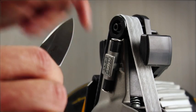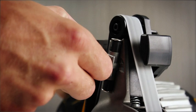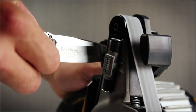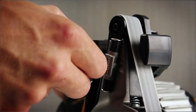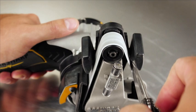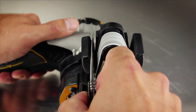Turn off the machine with the tip resting on the belt. After a burr is raised, repeat the same number of strokes on the other side. Once the blade is sharpened, hone the edge using finer belts. For best results, use alternating strokes on each side of the blade.